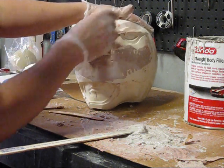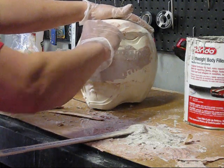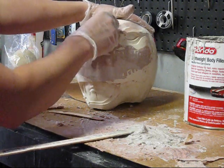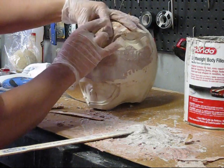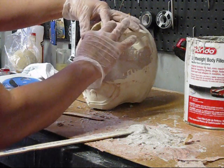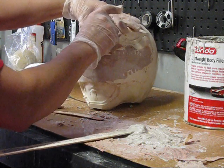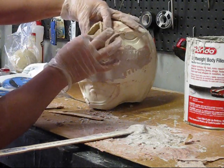This is a clay I used just in my shop. So what I did was I mixed a little of the plastic fibers in with it so it doesn't stick to the Bondo really bad, because as soon as the Bondo starts heating up, it'll melt the clay. It's hard to get out. So with those fibers in there, it never makes a good stick to this, and should be able to pull it right off.